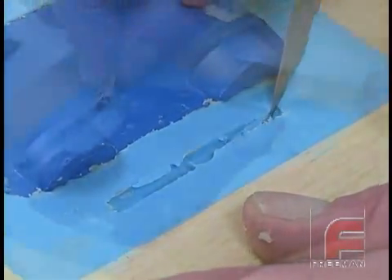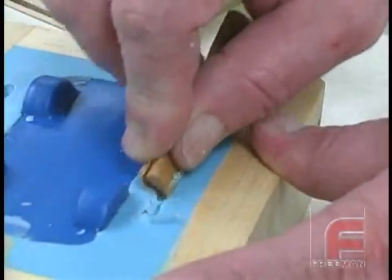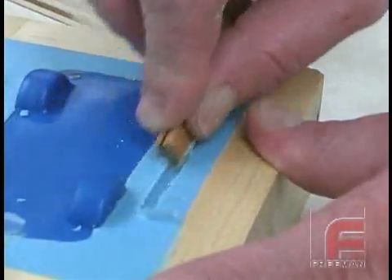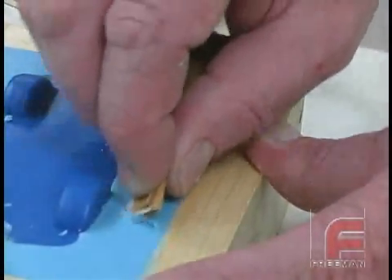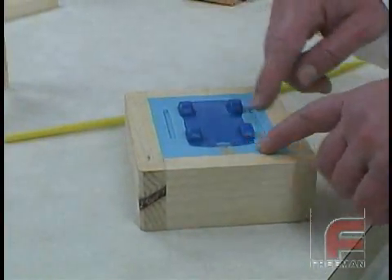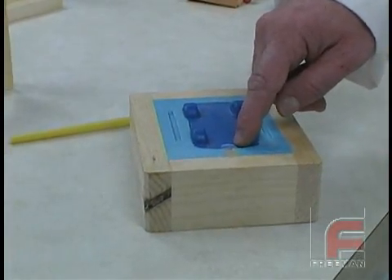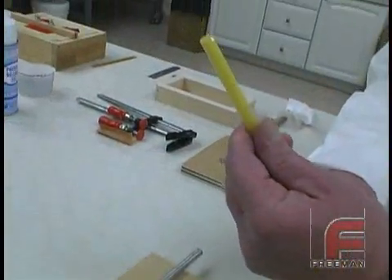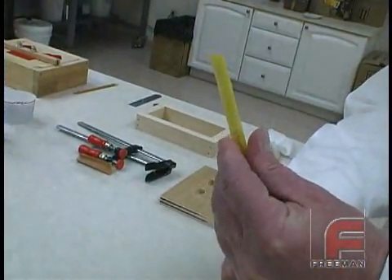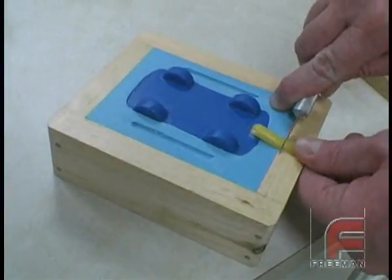To complete the cleanup, we use a small piece of folded sandpaper in the groove. The harder silicone rubbers like V340 can be sanded fairly easily to remove small amounts of excess material. The softer rubbers are more difficult to work with sandpaper. After cleaning the excess flash around the locking mechanism, we need to create the other half of our gate to form a wider, round hole through which the material will flow. On one end we are angling the tip, and on the other side, which will butt up against the frame, we cut at 90 degrees.